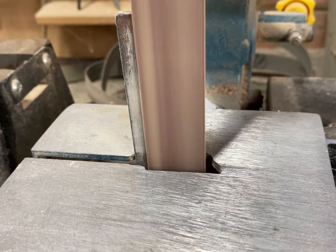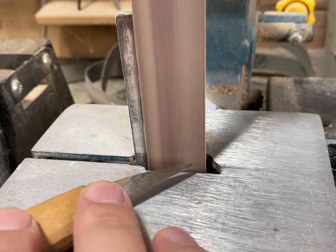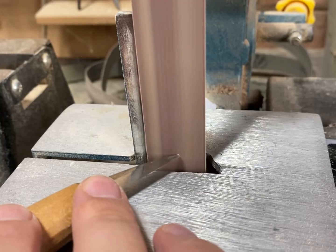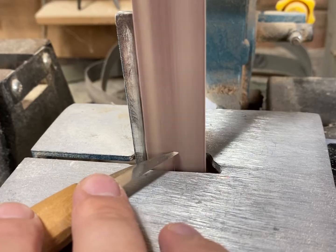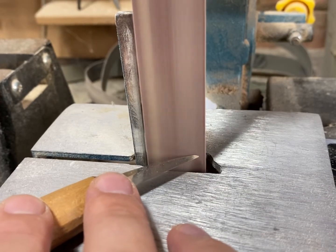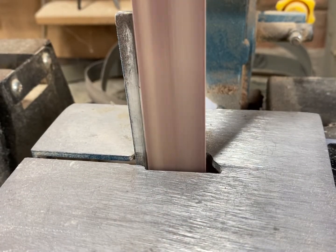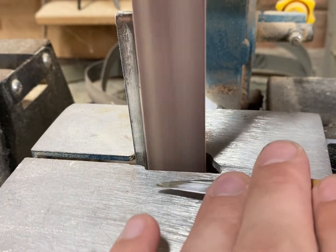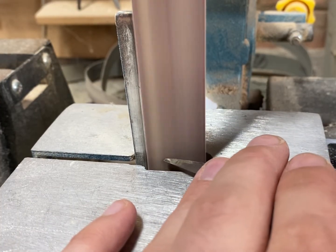To fix the first problem we need to grind the back edge of the knife back into a point, and I'm using a sanding station here to do that — very gently, with a low grit sandpaper, because we don't want to take off too much of the blade at once. If you're grinding the blade using this method, just remember to wear goggles because you may get a few sparks flying at you. If you don't have a sanding station, I'm going to quickly run through a couple of other techniques you can utilize to put the point back in your blade.